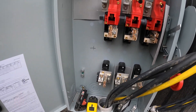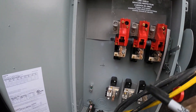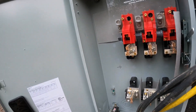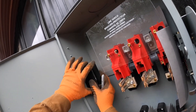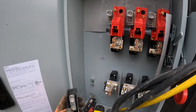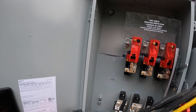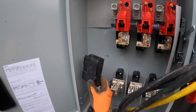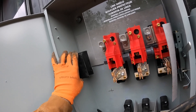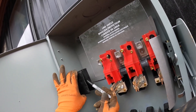I got a panel here — it's actually a three-phase panel. I found it cheap, used, and figured we'd throw it in here. But it doesn't have a neutral isolator. I was talking with my buddy; I was thinking about just running it through a fuse, and he said that's not a good idea. So I'm going to put this neutral isolator here, run the neutral up and around, and land it on this — which is going to be fun.